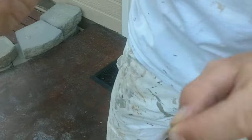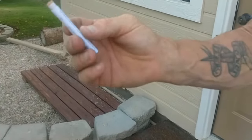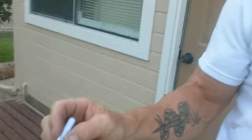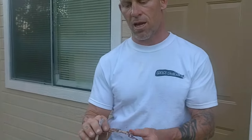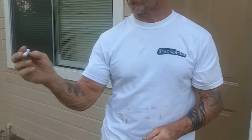My swab is still orange. This paint sample has multiple coats of paint on it. I'm getting some on my skin but it's safe — it's non-toxic, it's not going to hurt you. The lead check kit is still orange, so this paint sample — which actually came off a barn area that we're going to be scraping, sanding, and painting — was not positive for lead. A good, simple lead check test.